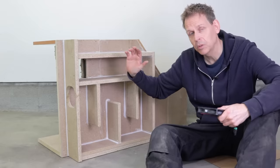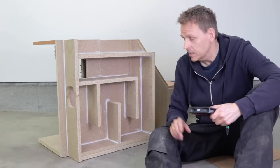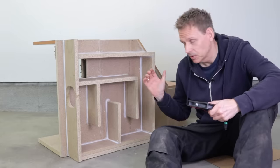And of course, the sound that will be reflecting back from the compressor will have to travel all this way to exit. And hopefully, this will also make it quieter. So not too much noise is getting out of the input and output. So what I have to do now is put on the fabric here, insulation. I'm using Rockwool 3 cm insulation on the inner part, and this thinner fabric on the input and output. And then put on the lid on the sides. And perhaps I should just transfer you back to the future, where I'm done with all of this work.